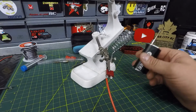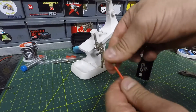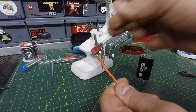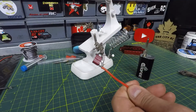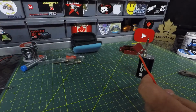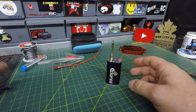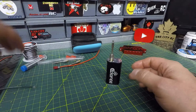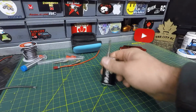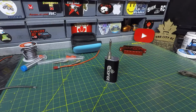So we're gonna call that a fail with the 12 gauge, but with the 18 gauge, we're good to go. That held on just great. So I think this is definitely something, guys, I'm gonna be throwing in the pack. It's definitely gonna be useful to me. For anything thicker, like a 12 gauge that needs repair, obviously it's not gonna be happening with this guy. I'd have to pack up and bring it home, but for everything else, less than that, definitely useful to me.